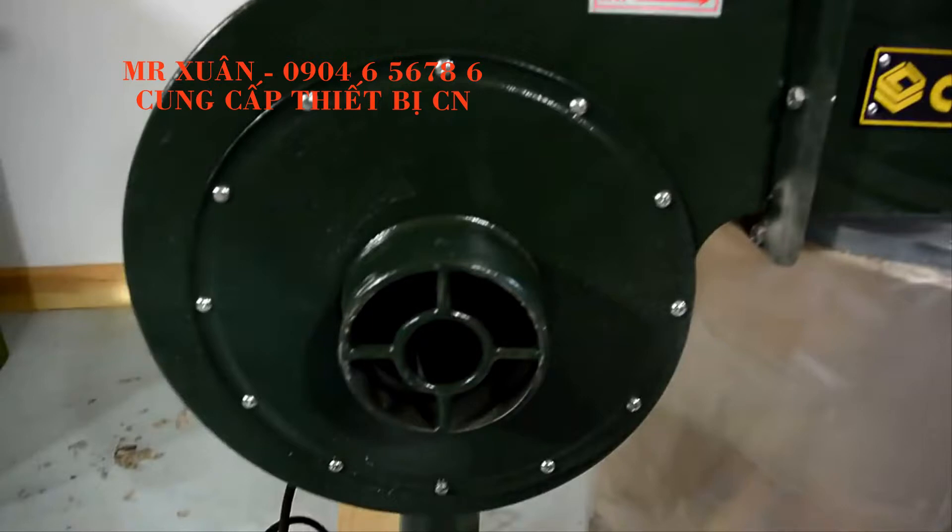Here's a cool test — dust collector versus dust collector. I've got the small one sucking out of the big one, but the big one's not turned on. Now let's turn on the big one and show you what happens. As you can see, the big one is able to out-suck the small one. The irony is this supposedly has a one horsepower motor and the big one only has a three-quarter horsepower motor, but the big one sucks better, so it must have a much more efficient impeller on it.